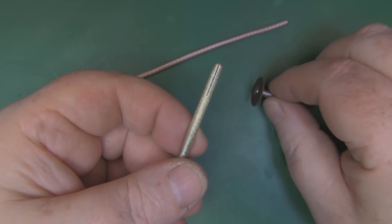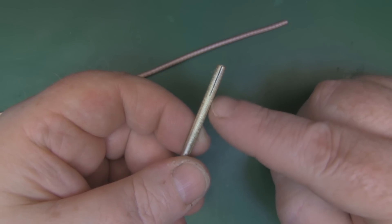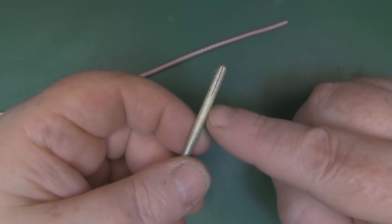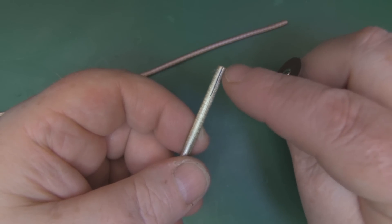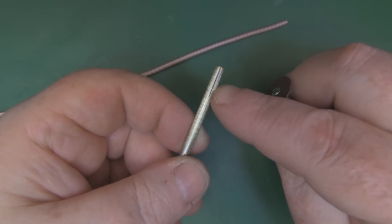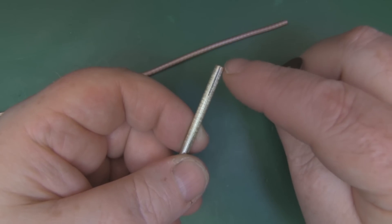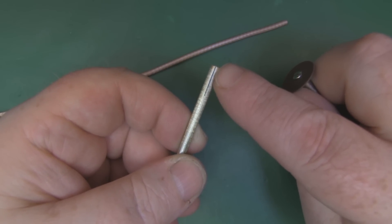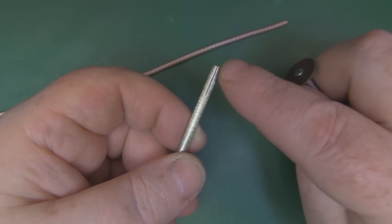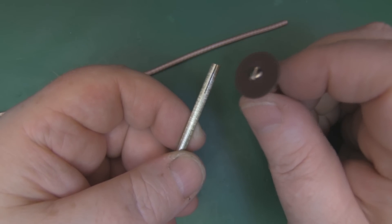Next I'm going to make the balun for this antenna. I've got the 4mm diameter tube cleaned up on the outside to make soldering easier, and I'm going to cut the slit in the balun first. I've marked off the slit length at 12.9mm, which is the quarter wavelength I'm working on. On the 2.4GHz version I left a 1mm gap from the edge before starting the slot, but I've since read it performs a little better if you don't, so I'm cutting the slit starting right at the top edge.